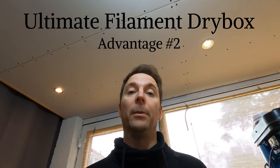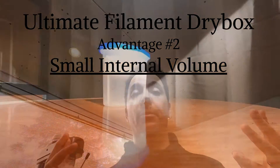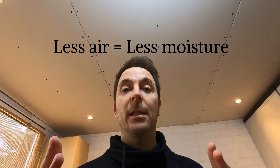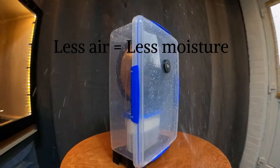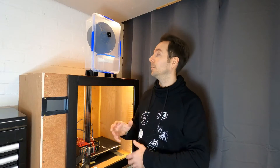Now the reason why this part is a little bit tricky brings us on to the second reason why this filament dry box is the one you need. I went for a box that has the smallest possible internal volume that will still take a roll of filament and a dehumidifier pack. The less air there is inside, the less air there is to dehumidify and therefore the less moisture there is to take out. I did consider using a bigger box with multiple reels, but the problem is every time you want to change a reel you're opening the box letting more damp air in. I wanted a box that would take one reel, one dehumidifier pack, and keep that same air in the box from when the reel is new till the reel is done. If you want me to look at an option that takes more than one reel drop a comment below.